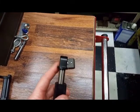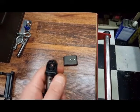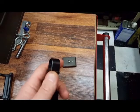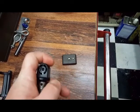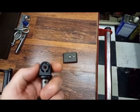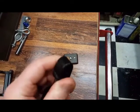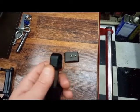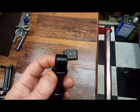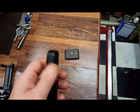So I'll do that on the milling machine. It shouldn't take much. I may have to saw a chunk, fly cut the ends or whatever, then cut this radius, which shouldn't be too hard. Drill a hole and cut a radius. Then cut a radius on a milling machine is no big deal. It doesn't look the prettiest thing in the world, but hey, it gets the job done. So I'll take some measurements and get a chunk of material up in the mill, and we'll start chopping it up.